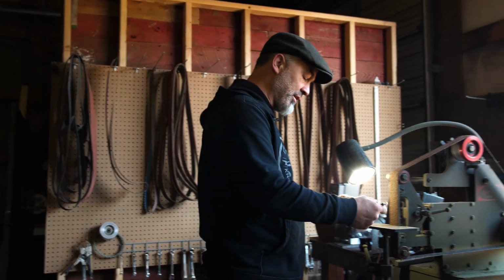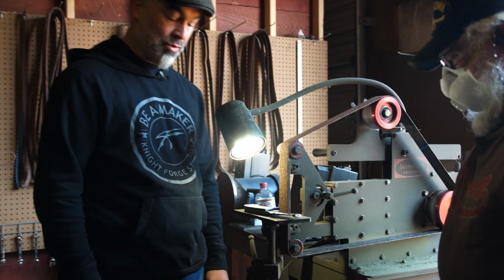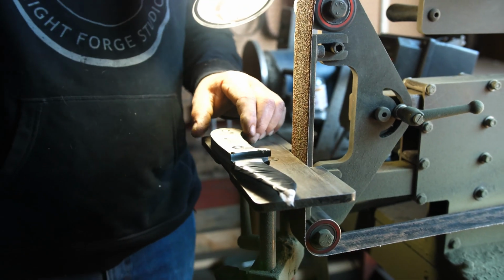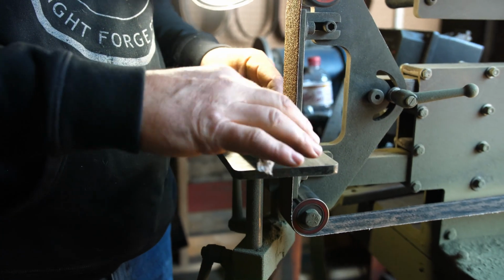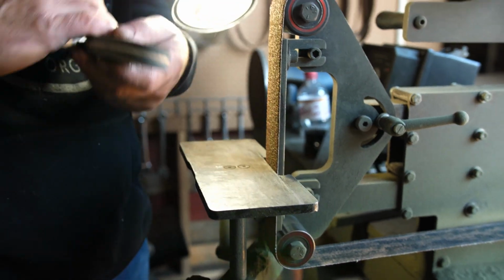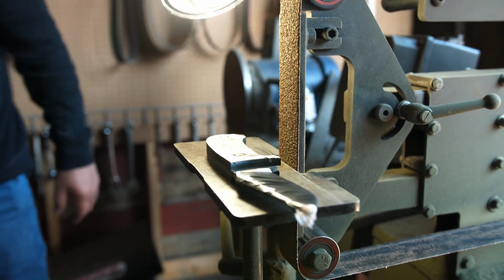All right, now, first thing you do, you're gonna hit that little bump right there. Gotta see this. If you don't see it, it won't make sense. You'll take more than I want you to take. That's just a little arc, a radius, an arc. That's a line that looks like this. Like early in the morning when the sun starts to come up, that little bump. All right. And then you're going to go in here, and this is another arc. It's like the reverse, and you're going to swoop, swoop, and then you can finish it. And sometimes you have to turn it around and then do it this way. Okay? This is going to be a little more sloppy, but I don't want you to worry about it because we're going to fix them. They're going to get better and better as we up the grit. Okay?